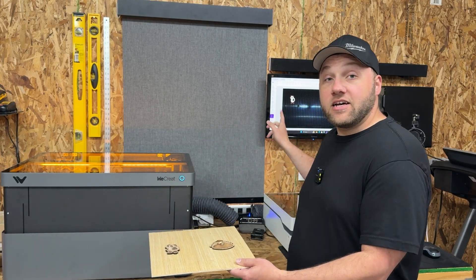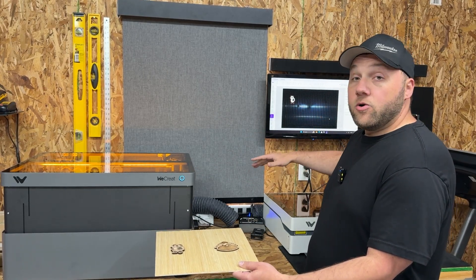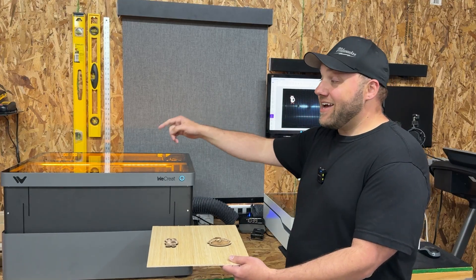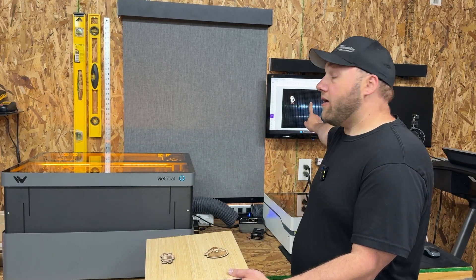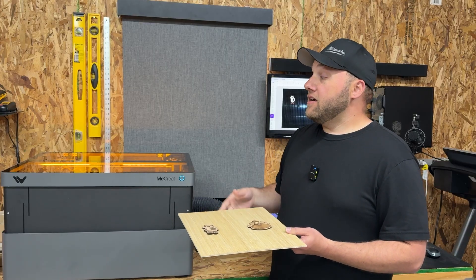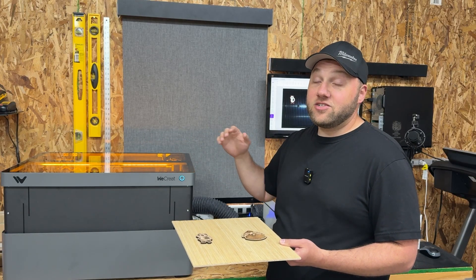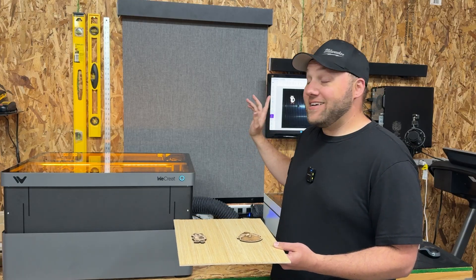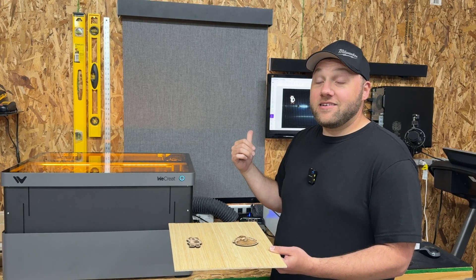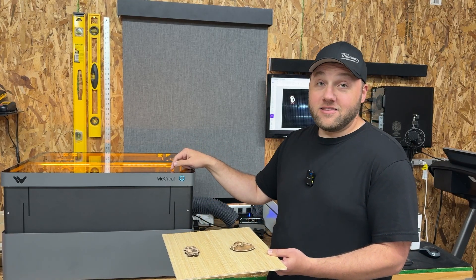Use a piece of tape right over the engraving and see if it pulls out. If it doesn't pull out, leave it there and hit cut again in the same spot. But if you have to autofocus again, click autofocus — it'll lower, and then this image is going to look off-center. Do not move the image. That image is technically exactly where it landed before, but your autofocus is throwing off the image on your fisheye camera. Whenever you do an autofocus, if it's not measuring the exact same height, your fisheye camera lens is going to show it shifted in the software. Leave it exactly where it is, click print, and it should land exactly on top.